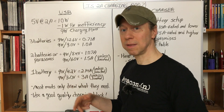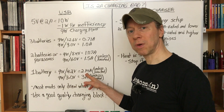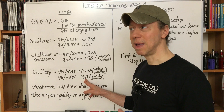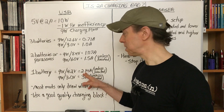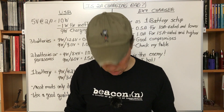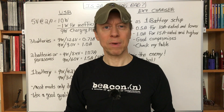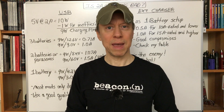If we have a single-battery device that advertises 2-amp charging, now it's a little bit of a concern. At 4.2 volts we've got a little over 2 amps going to the battery unless it's limited inside the mod, and with a fully discharged battery we're down at 3 amps. I'm pretty sure most devices do not output 3 amps to the battery, but I suspect it won't be anything over 2 amps. So once you're down to a 1-battery mod, it's possible you could be running that battery very hard. Put in a basic 20-amp battery, charging at 2 amps every time — that shortens the battery life a little bit. It's not going to just blow up, but if you feel it running a little bit warm, that's aging the battery.